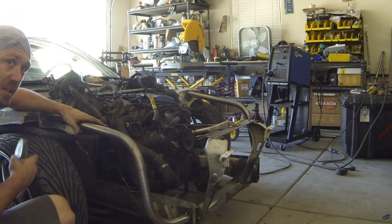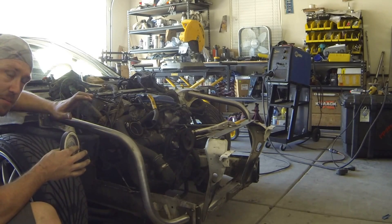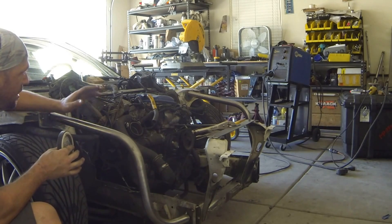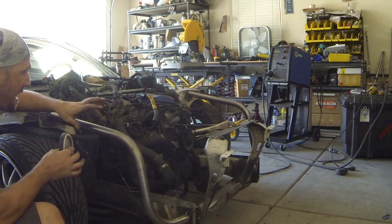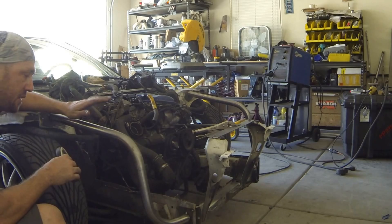I'm going to leave them just tacked in place right now — but strongly tacked in place. I don't want anything like twisting or bending of the chassis, or bumping the tube, or anything that would knock a weld out. So I'm going to throw a few more tacks in place but leave them accessible in the event that I have to cut the tube off or something changes along the way. I'm not going to fully weld it just yet.